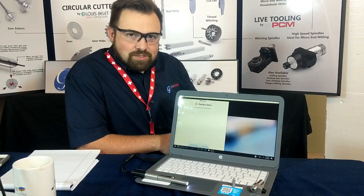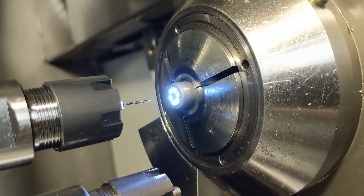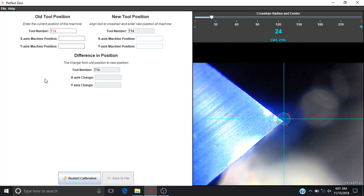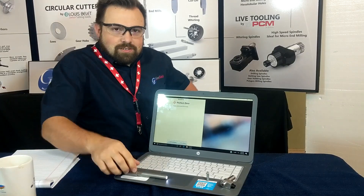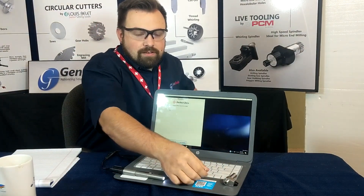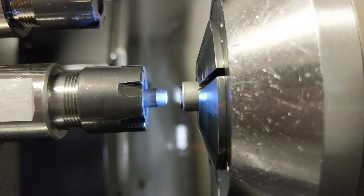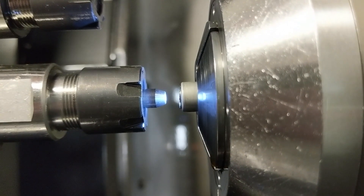The system is used for visually aligning micro ID tools as well as OD tools at the point of cut using visual optics. The system includes a guide bushing camera, pick off camera, and visual target, which are utilized to calibrate the cameras for the eccentricity that's inherent in all rotating assemblies.